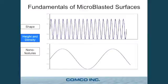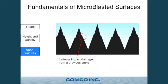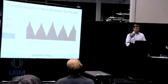There are three fundamentals to cover. First is shape. The next is height and density — how do you characterize the height of the surface, from peak to valley, or midline to peak, or midline to average. You can also quantify frequency: how close together are those peaks? And lastly is nano features. In a sawtooth pattern, the valleys created last by the most recent abrasive impact aren't completely erased by subsequent impacts on a ductile material, leaving small leftover features we call nano features. These have an interplay when doing things like osseointegration or inhibiting bacteria growth on medical implants.